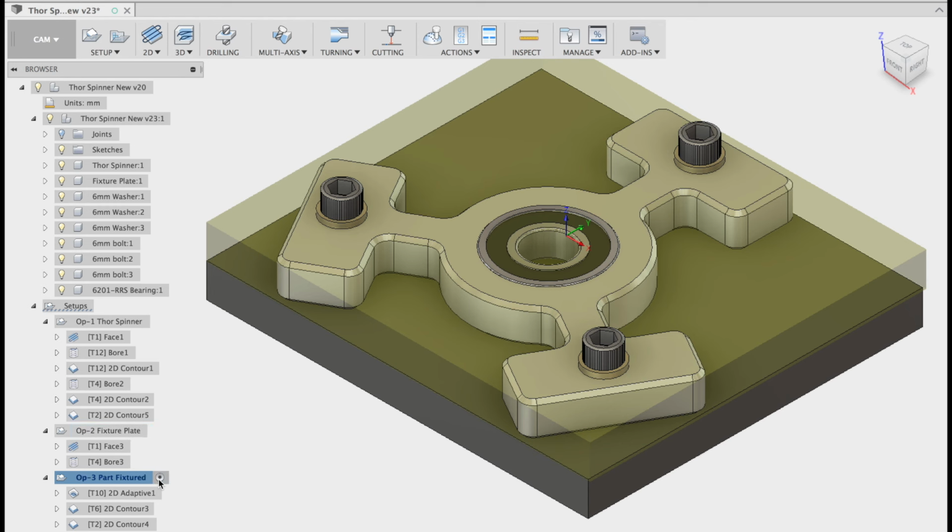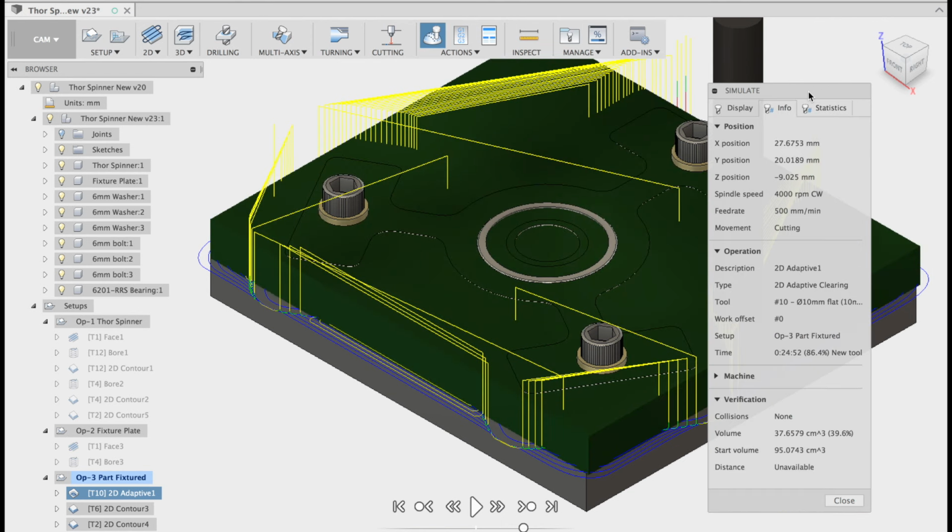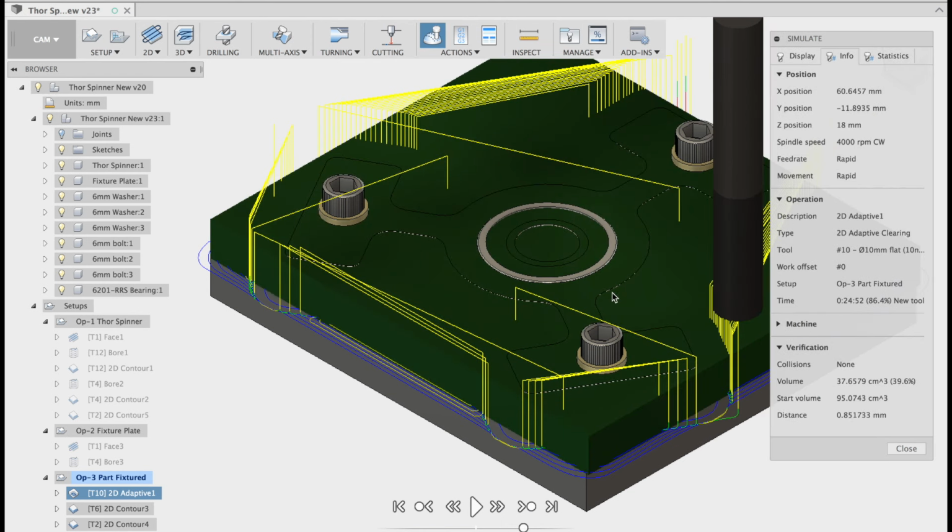All right, activate the subfolder. Let's look at that, guys. A little bit more work going on here. It's going to be a little bit busier. Okay, I'm going to rough all these out. I believe it was with the 10 mil end mill. Okay, you can use the 3/8 end mill if you want. Just remember to change the tool in the tool pass section.